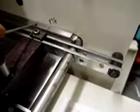You just loosen the set screws on both sides, operator side and non-operator side. Move it to the position on the scale. Now here, they have an SAE scale. Somebody put that in there because it comes with a metric. I'm glad they did that. Probably something we should try to do with all of them, but it's so hard to find these rulers. Anyway, this is an 8 1/2 inch scale, SAE scale. So you can set it at wherever you want to trim your booklet. And now basically it's set.